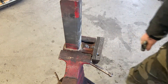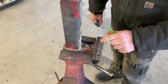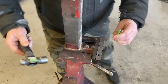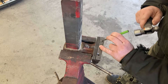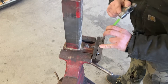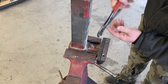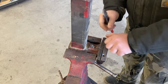One of the things I like to do when you encounter a fastener like a machine screw that's stripped out is you can tap your way around it until you can get enough to get something like my Knipex pliers on there. Using a punch or a chisel, you can start it, and now I've got enough that I can pinch it with my pliers to get that baby out.